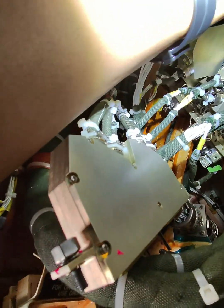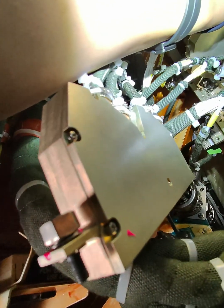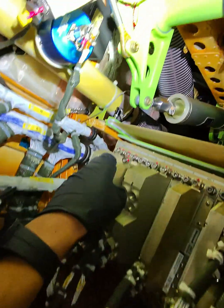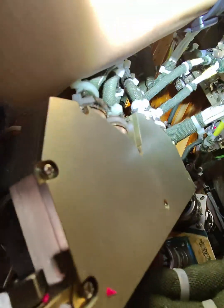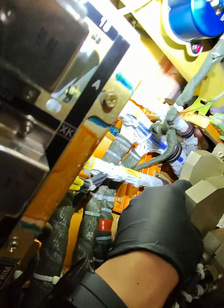We have to double-check that the port number matches with the new unit. They're both serialized, so for the new one there's paperwork on it — we're going to make sure the serial number matches with the new item. Then we just install the new one the same way it came out: slide it all the way in, then screw both bolts evenly at the same time.